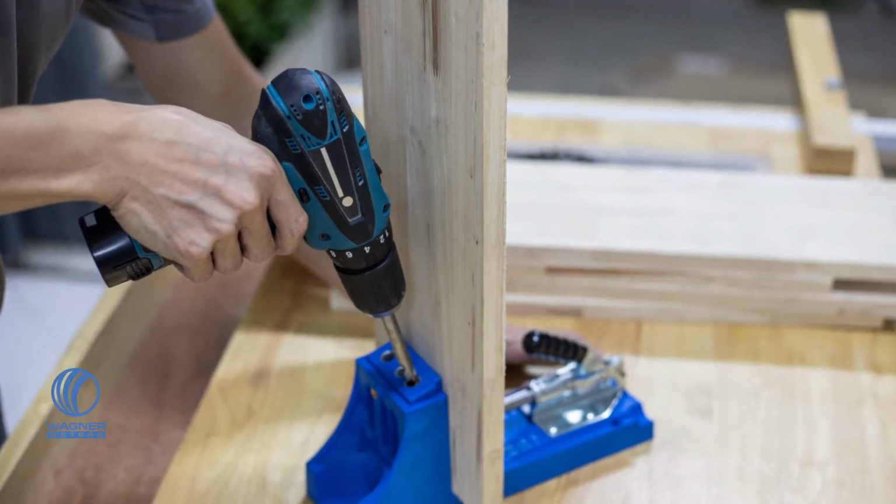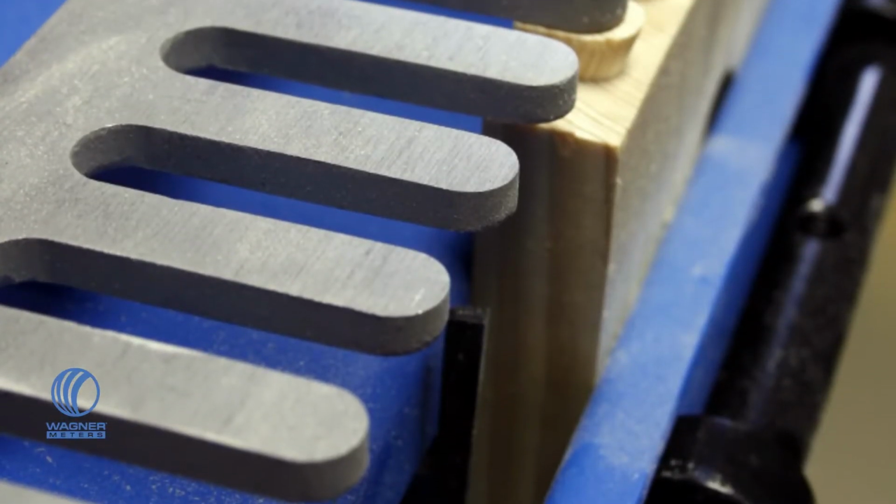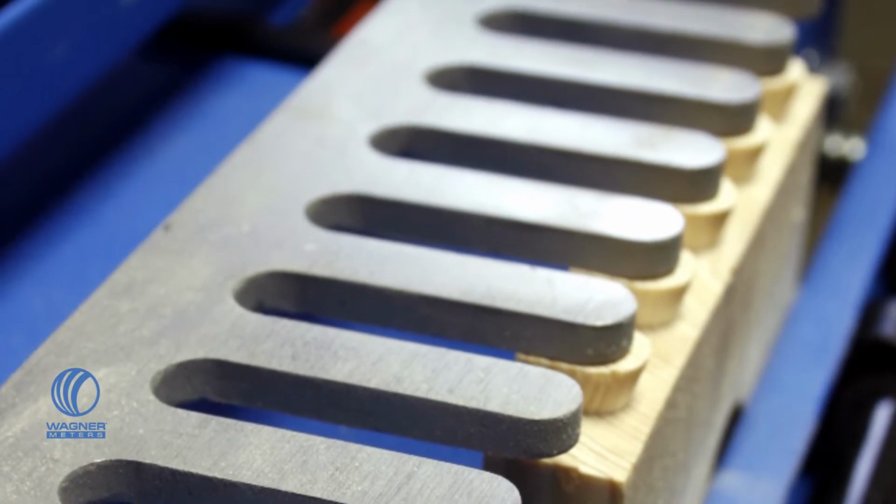Jigs! You don't have to measure every single cut and joint if you have jigs. Most woodworkers make their own jigs. You usually use a jig with a power tool to guide the piece through the saw. You can make a jig that you can use to cut a perfect circle. Maybe you need to make furniture with tapered legs. A jig will accomplish this without the hassle of remarking the angles on each leg. A dovetail jig does just that. It guides your wood as you make dovetail joints.